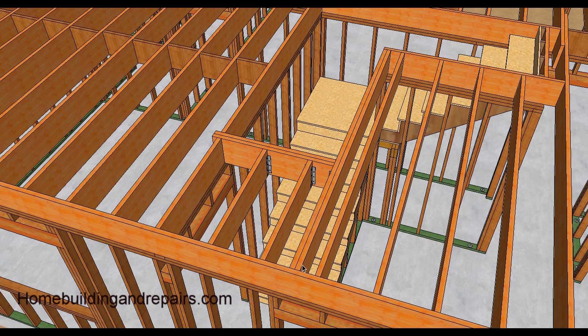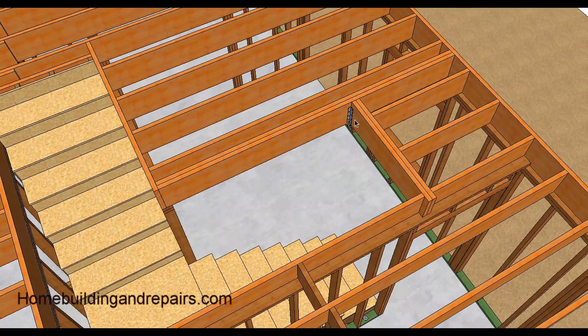For example, if there was a post here supporting some part of the roof, then this might need to be a 6x10 or 6x12 — something larger to support it. The doubler connects into this doubler here and is usually attached with hangers: single hangers for single joists, double hangers for double joists. This would be a double hanger here. You can also see the backing for the drywall and the doublers.